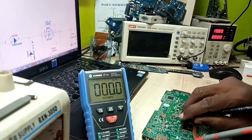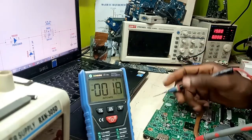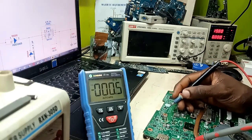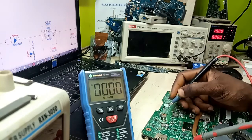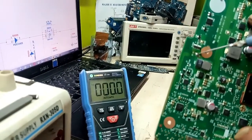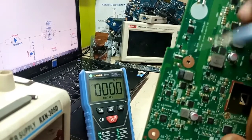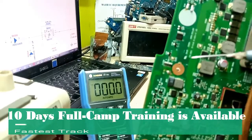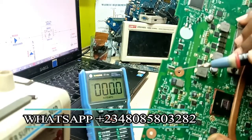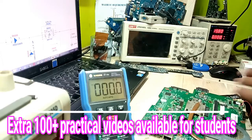There is nothing at the 5V coil. I insulated this 5V coil to see if the voltage would regenerate. After insulating, still the same thing — the voltage was not generating. As you can see, this is the part where I insulated the jumper pad. This is the coil, this is the capacitor, this is the jumper pad — I've insulated it and joined it back, but still the voltage was not generating.